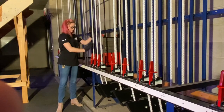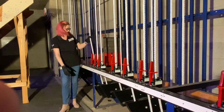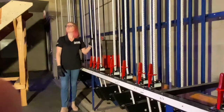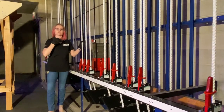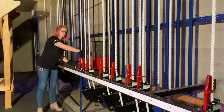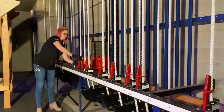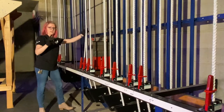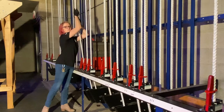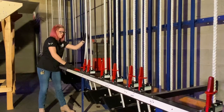First I'm going to yell that out — I'm not even going to unlock anything to make it unsafe. 'Line set 16, coming in.' 'Thank you, line set.' Good, so first we'll squeeze the rope to the handlock, just to make sure the ring is loose, to lift it up and drop it. It's still not unlocked — I have seen students immediately start pulling. It is not unlocked; we have to first drop the handlock.